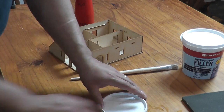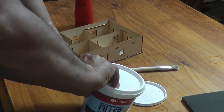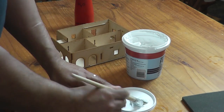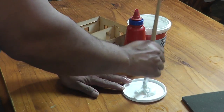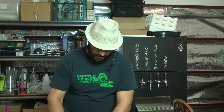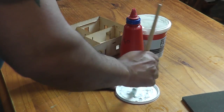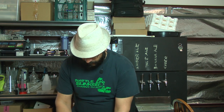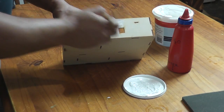I've got here on the table a little saucer and some ready-mixed filler. All we're going to do is take some of this stuff, put it on a little saucer, and mix a little bit of water in with it. How much water you add depends on experience and the filler you're using, but we want something kind of like a runnier toothpaste consistency.